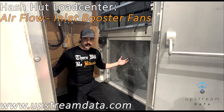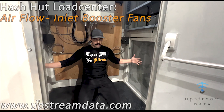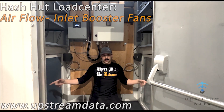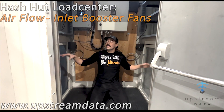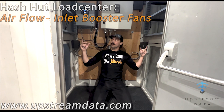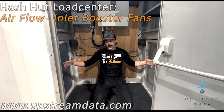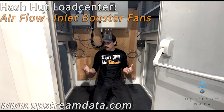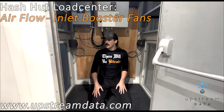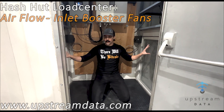Another benefit is that it creates positive pressure on the building. You have two opposing fans — one on each side — as the air comes in it's creating positive pressure, lifting up and exiting. This is an intentionally inefficient path for airflow, but the reason is to protect your hardware from snow or rain ingress, because anything that gets past the filters has a higher likelihood to drop out on the floor, especially heavy particulate.